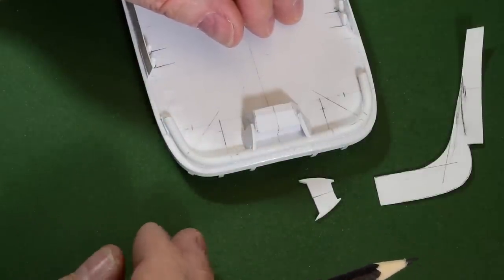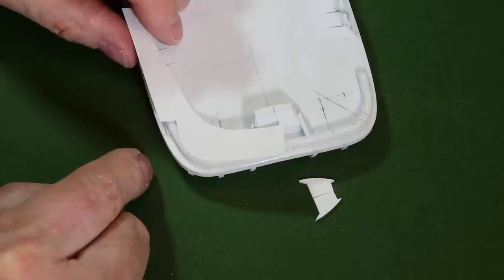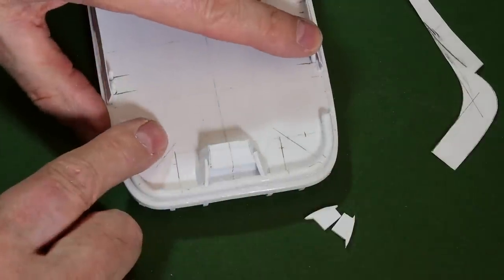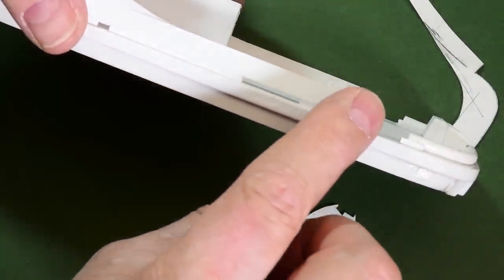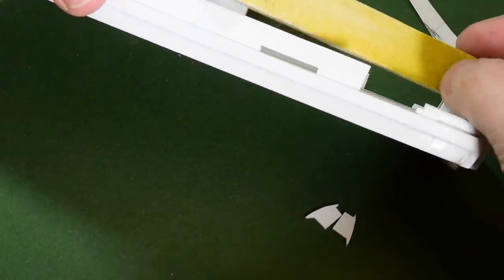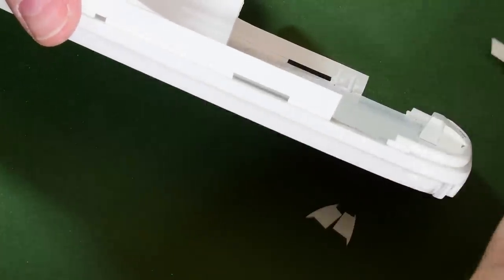And there's many different ways to do that, but one of the issues you can see here is I'm trying to develop this piece. I only need to do this half, remember? Because once this is done, it'll be pretty darn close on this side as well. But here's the challenge. When you curve this plate here, this fairing, when it starts to curve and roll over, I need to maintain the same line all the way across to where you see that rear bollard block, right where my thumb is. That line has to stay straight. So as that rolls over, it would drop down if you cut it like a straight line.